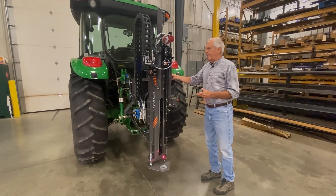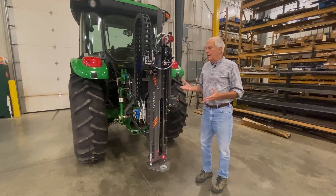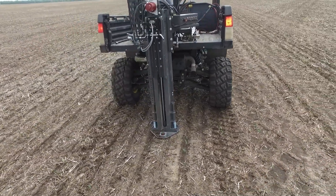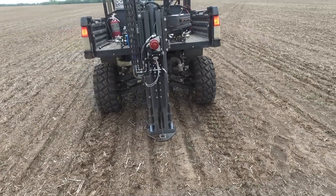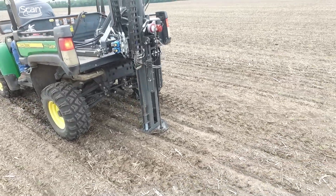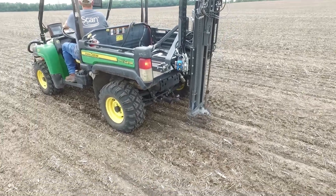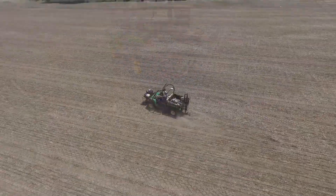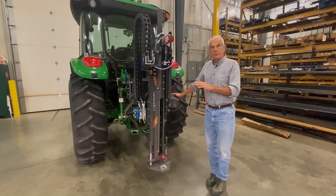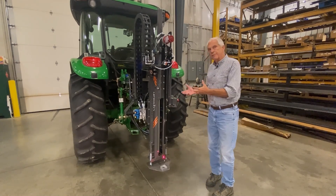In order to be able to map a field intensely and quickly, you have to have an automatic probe. You can't have the operator having to get off the vehicle and run controls. In order to get a probe every acre in just a few seconds, it's got to be automatic. We've designed this with great autonomy — as soon as the tractor or vehicle stops, the sensor probe goes down and comes back automatically. And if it hits something like a rock that's going to cause damage, it retracts immediately. It'll be great once tractors are automated, because there's really no need for the operator to be in the vehicle other than to steer it, since it's highly automatic.